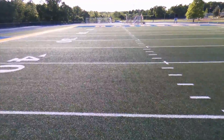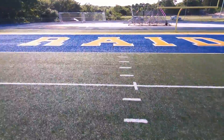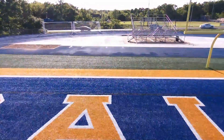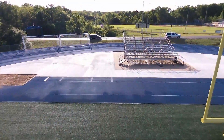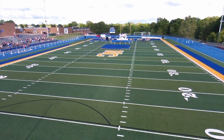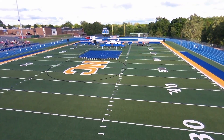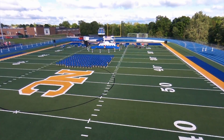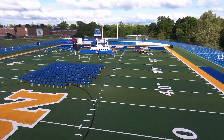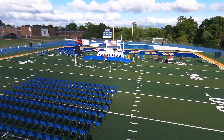After it landed, the drone was really hot, and both times this happened, it was after the drone had been on for maybe an hour. What I would do is fly, then land, hook it up and dump the video — that would take a few minutes — then unplug, change the battery, and fly again. So it was basically on for an hour straight when this happened.